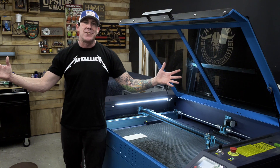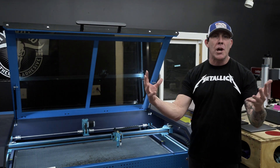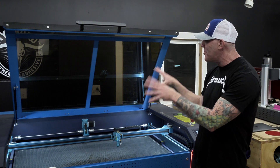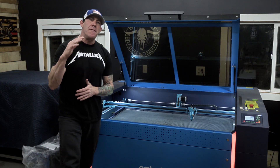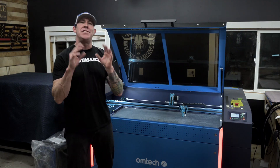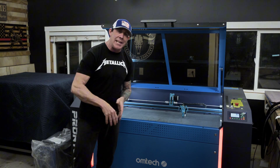The Pronto also features a couple of air pressure safety switches — the laser will shut down and stop running just in case it loses air. This is a safety feature designed to help preserve the laser and the optics in case you lose air pressure. And a reality often overlooked: yes, this is a laser engraver — these produce heat and sometimes they can catch fire. Inside the Pronto, they do have a heat detection alarm system. If the machine starts to overheat or detects a fire, it's going to shut down immediately and send an alarm.